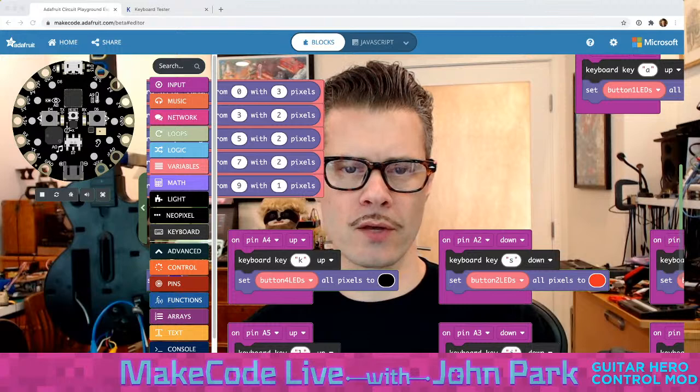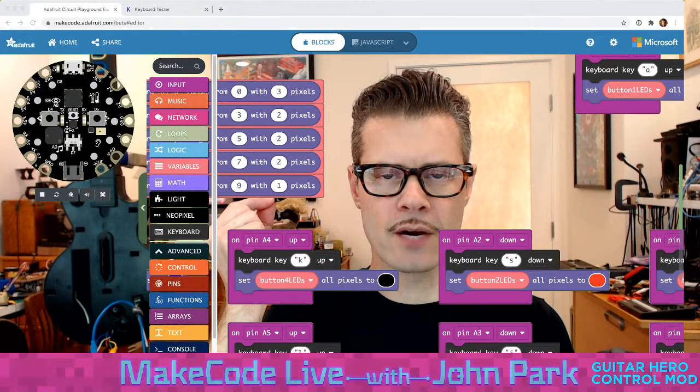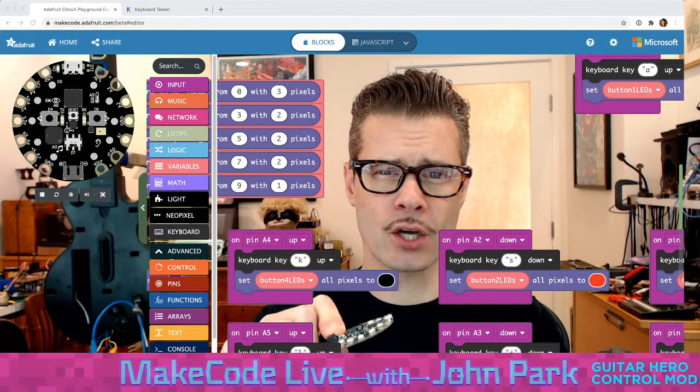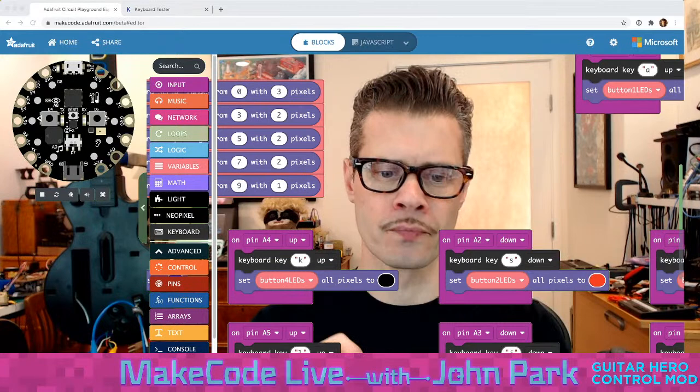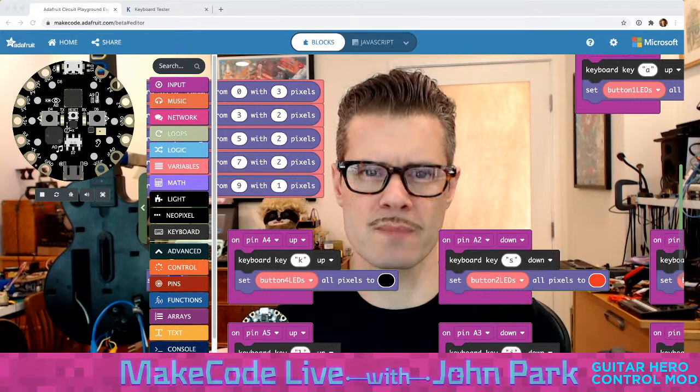Some mention of CircuitPython — yeah, you could definitely use CircuitPython to do this. The way we're doing this is on the CircuitPlayground Express, but this would work with nearly every board I've ever used on MakeCode. There's the Adafruit MakeCode just for CircuitPlayground Express, then there's Maker.MakeCode which covers a wide range of boards, and then there's the MicroBit MakeCode. Pretty much all of those boards that run MakeCode have USB HID — so they can read in buttons being pressed and write out USB HID.